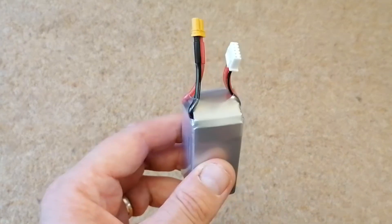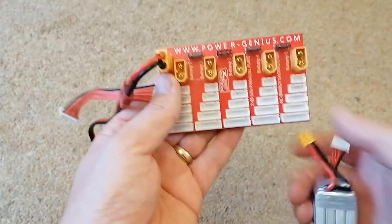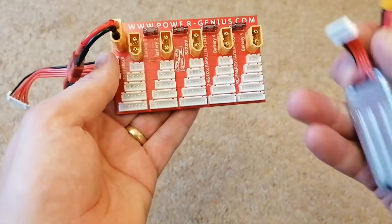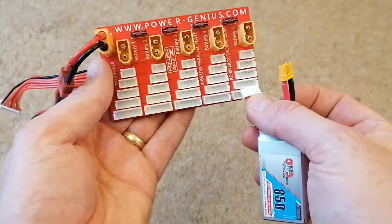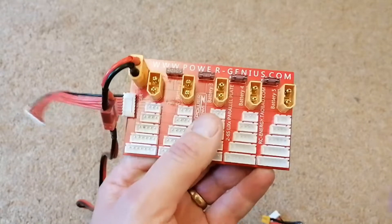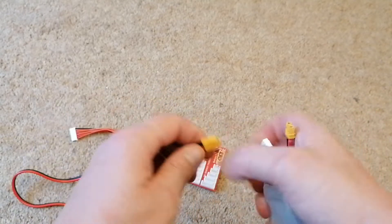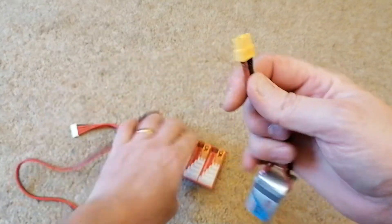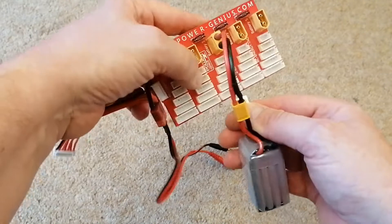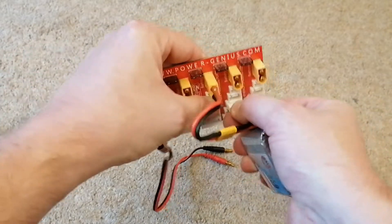What to do now? For my other batteries I've got my standard charging here for the XT60. Do you buy an adapter for each one? If you've got three or four batteries, do you start putting adapters on them? These will allow up to six-cell. I never even thought about it. So what I've done is I've made some of these extensions — the battery connector goes in here, your XT60 goes in there, and your little 4S connector goes in there. It works.